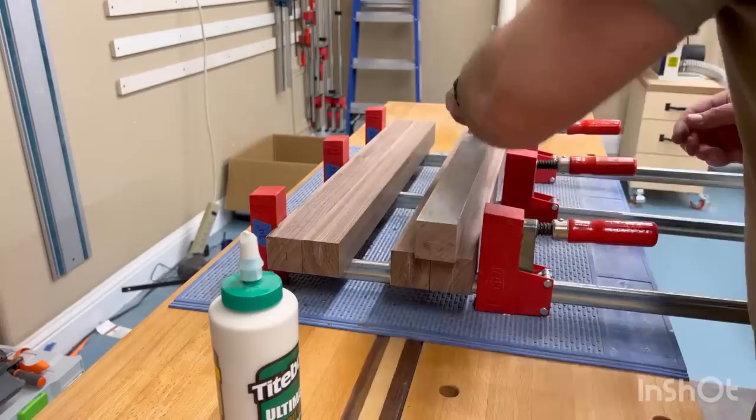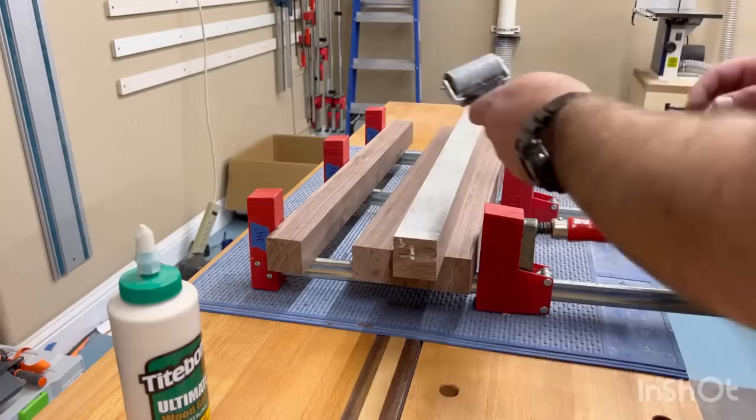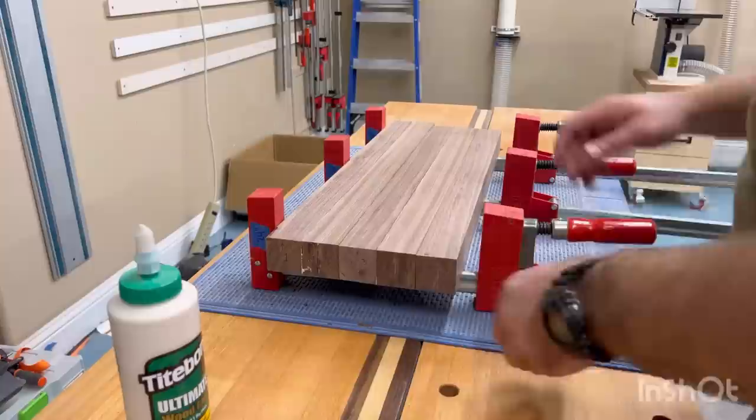So instead, I decided to do the glue up in two phases. First, I glued up each half so that I could run each through the planer and thickness them again together. In this way, it would be simpler for the final glue up to only have to manage gluing two pieces and keeping them flat and coplanar versus managing 13 strips at once. This will make more sense visually in a minute here.